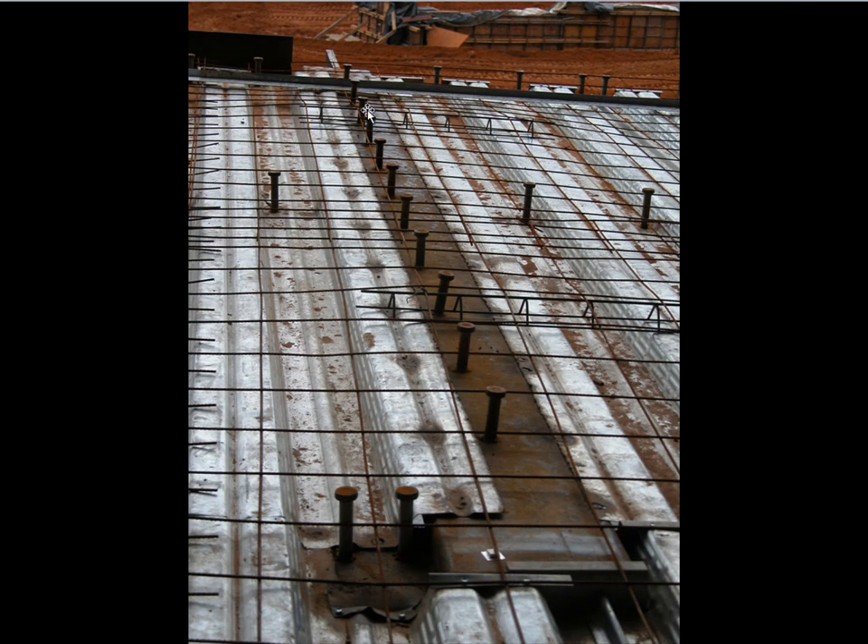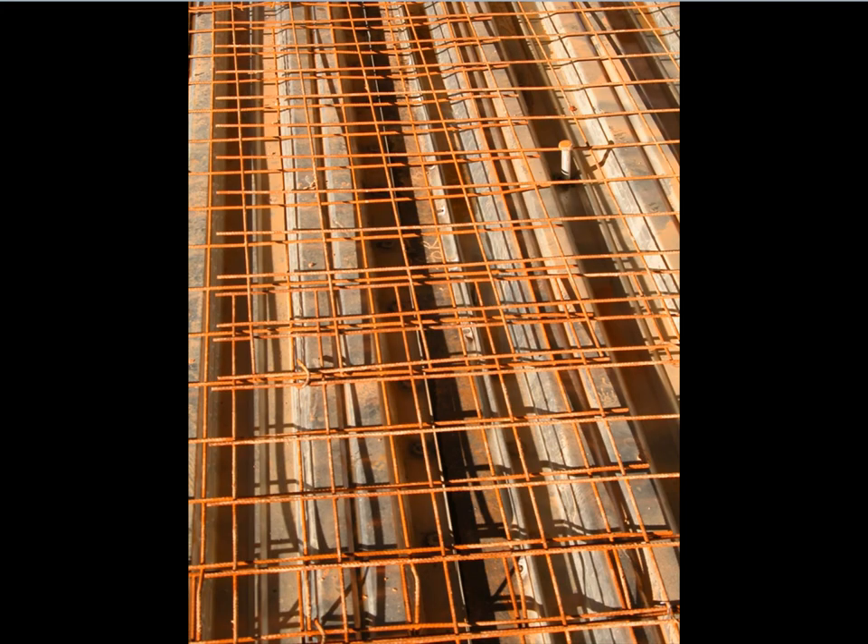This shows a pattern of shear studs on a girder — or in this case actually a drag strut on top of a girder. These are very sturdy studs, and then there are secondary studs along here that connect to the tops of the joists, which are the filler beams or secondary beams. Anywhere this wire mesh terminates, rather than wiring to other mesh, we just create overlaps. Here we're looking at an overlap point where four different pieces of welded wire mesh are intersecting — that's a maximum density condition you might observe.